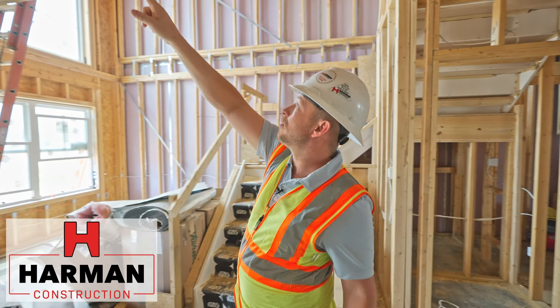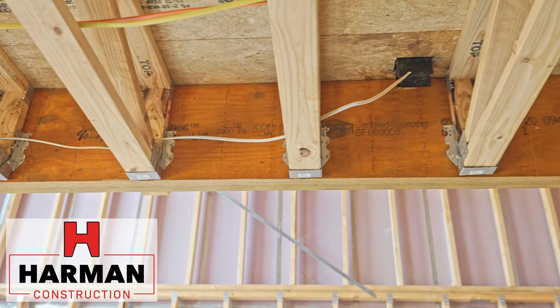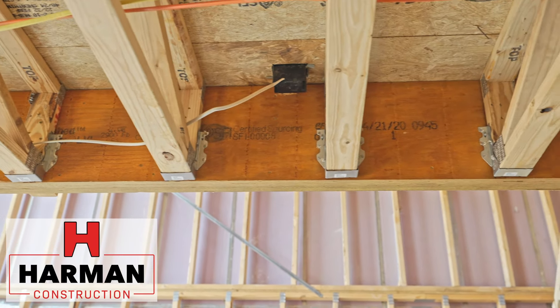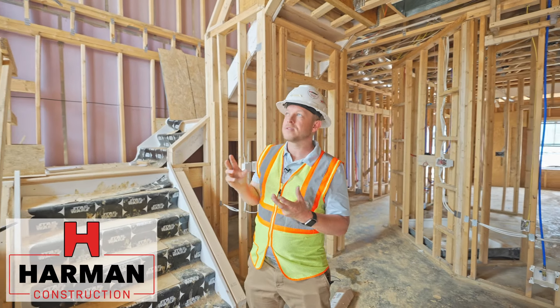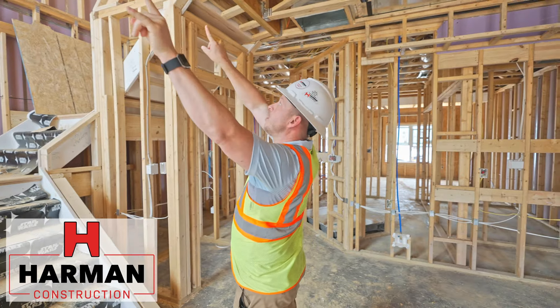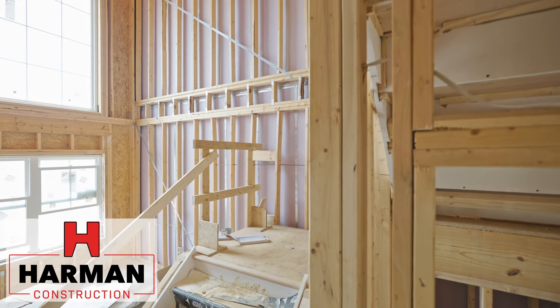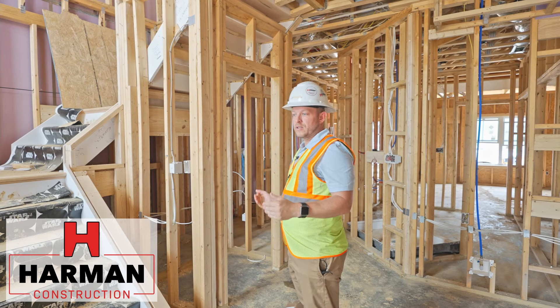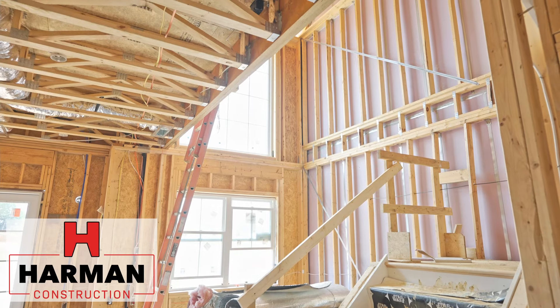The combination of these floor trusses that you see come across, tying into the LVL via these silver brackets — which are Simpson hangers — that combination of those systems ties into one another and transfers the load all the way across and down. What that does is allow this whole area to not have a bearing wall here and opens this floor up.